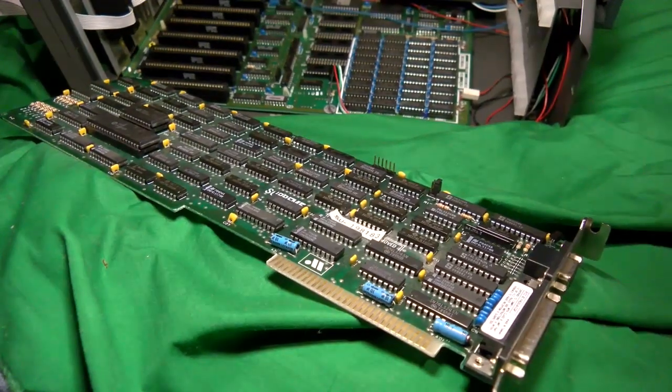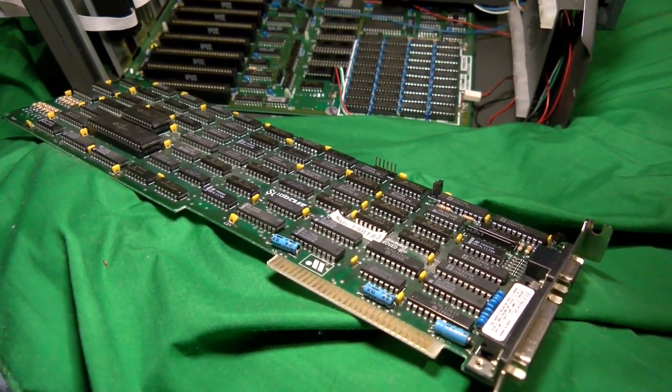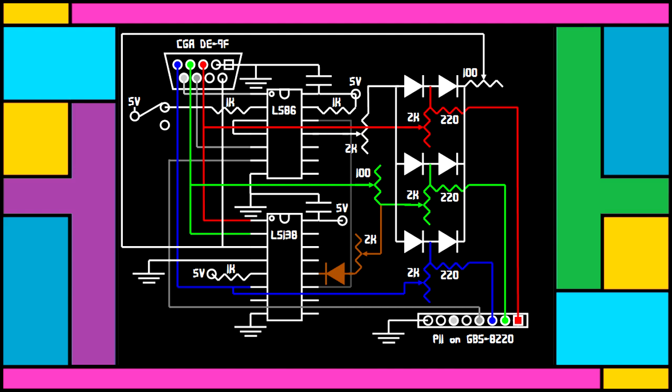In any case, I'll leave a link to H2 Obsession's design in the description, and here's my schematic of it if you want to copy off that. I think his has an issue with one of the pins on the 74LS86, where I'm sure it uses the wrong pin for something. You just check the data sheets if you're going to try and assemble this thing. Whatever, anyway, it's a simple enough thing.